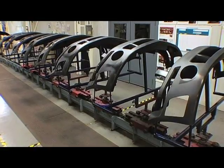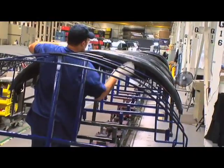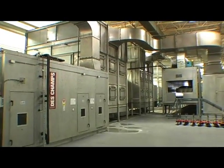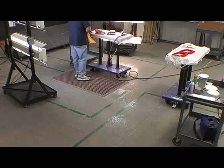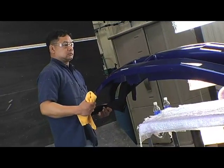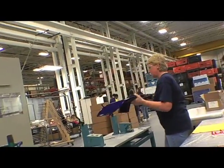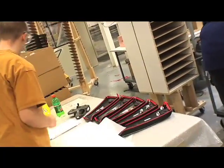Hi, I'm Chris Maevelle. I'm here at Roush Manufacturing standing in front of our paint line operation. What's happening here is where we load all the plastic parts that are painted inside this facility. They go through a power wash and an automated paint process through an oven cure and come back out as a finished part three hours later. After the part comes off our paint line, we have an inspection station here. These guys will go through the part, inspect it, make any repairs, and fully polish the part out. At that point all the parts will continue in this direction, which is an assembly or kitting area. There may be some assembly, or it's packaged and kitted off and then shipped out.